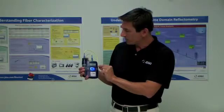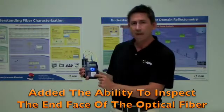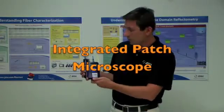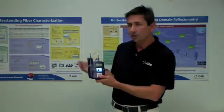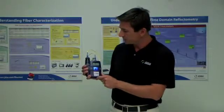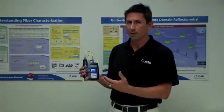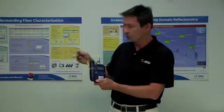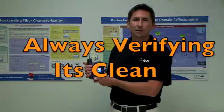We've taken this broad spectrum power meter and added the ability to inspect the end face of the optical fiber. So now, with the integrated patch cord microscope, we can always see the end face of the test lead that we're about to plug into our system and measure power. This integration of features gives the technician really everything he needs to do his job properly. He's no longer blindly plugging this test lead into the optical port — he's always verifying that it's clean and safe to connect.